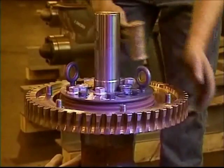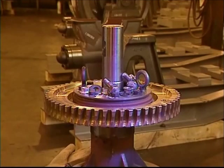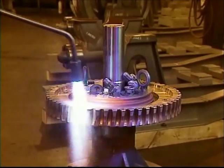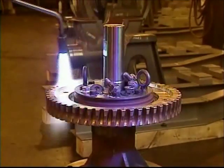Use a soft hammer to tap the body bolts and remove them from the gear and gear center. The gear and the center assembly have been machined for a shrink fit to achieve the tightest possible fit. In order to remove the gear, use a rosebud torch or an equivalent high BTU torch to heat the gear in a circular motion, causing the gear to expand.